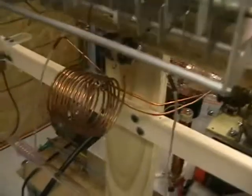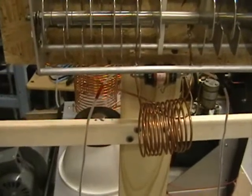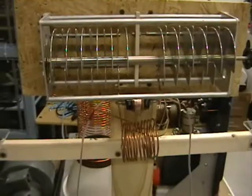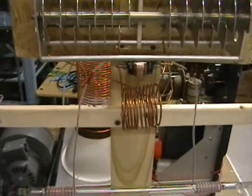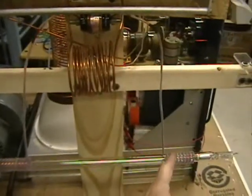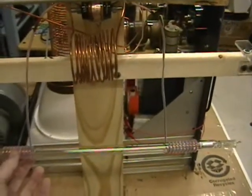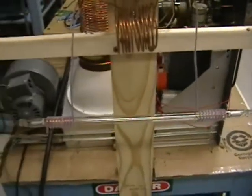We don't want to radiate any extra power at this frequency because this is in the shortwave band, and we do not wish to cause any interference to shortwave broadcasters. The parallel tuning network develops about 5,000 volts RF across the two leads fed to the tube, causing ignition of the gas in the tube, and a powerful discharge occurs during normal operation.